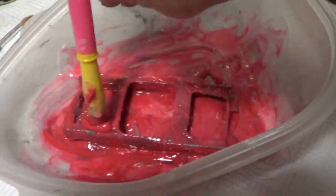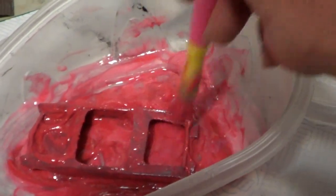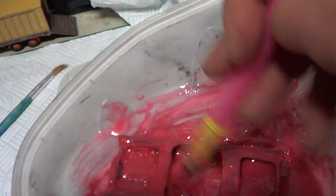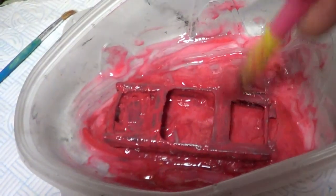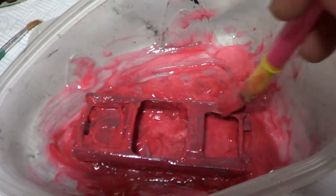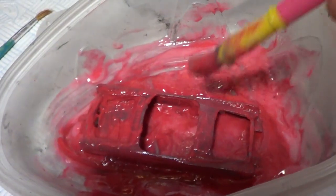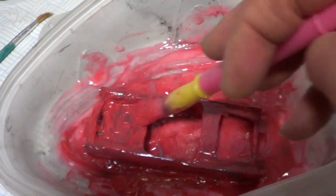When I painted it, I always warm my paint in the sink in the kitchen in the hot water, because it sprays better obviously, and so a droplet of water must have got somewhere near the nozzle when I did that, must have splashed it without noticing. Anyway, I painted the red on this casting and I got a blob of water in. So I thought, if I put a cocktail stick in I might be able to get it out. Anyway, I sort of managed to get it out, but then it left a mark.